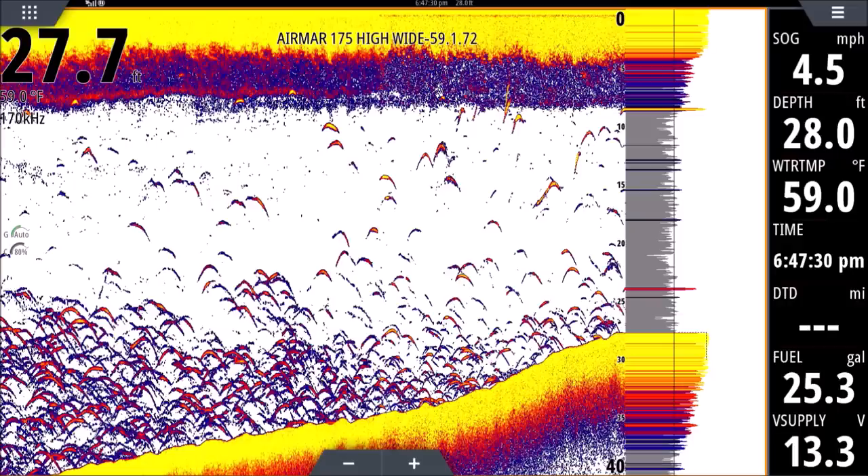When you're deeper, your cone is wider, so more things can interrupt the ping and you get more returns. Now let's talk about the shape of the returns. If your fish finder is set up correctly and you're moving four, five, or six miles an hour, you should see arches. If you're getting half arches, your transducer may need to be adjusted. The hardest return from a fish comes from their air bladder. With new chirp sonar we can still mark the fish itself, but the air bladder gives a really sharp, high-contrast return — and it looks like an arch because we're moving up and across and past the fish.